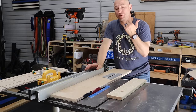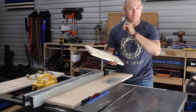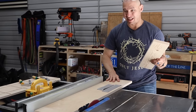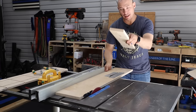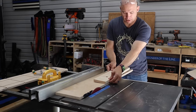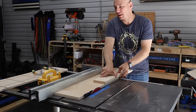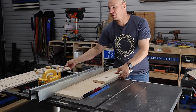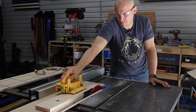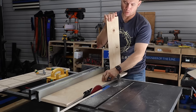I would actually not recommend using duct tape for this because when you double it over, it's going to be really thick — that's why you should use double-sided tape, which is really thin. For demonstration purposes, you're just going to take the tape on a piece of plywood, then take your board that you want jointed and just barely hang it over the edge so the blade is actually going to make the cut. Set it on top of the tape — that's going to keep everything from slipping and moving, similar to what the clamps do on the sled. Once it's stuck, you just run it through. That easy. Then all you have to do is peel it up, take the double-sided tape off your board, and you've got a jointed edge.